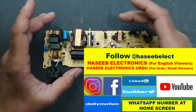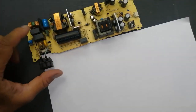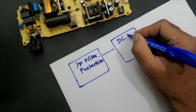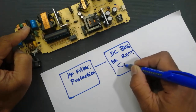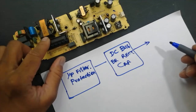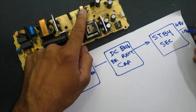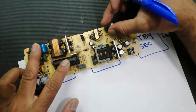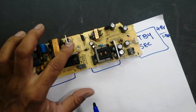Let's see the design. In this first video we will see its major parts and divide this power supply into four portions. Looking at the input portion, it is an input filter and protection section. Then we have the DC bus, which has a bridge rectifier and capacitor. This will give power to the standby section, which gives us 4.8 volts at 1.5 ampere. Then we have another portion called PFC — Power Factor Correction.